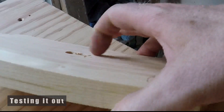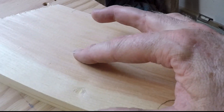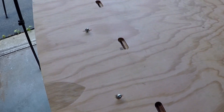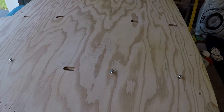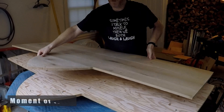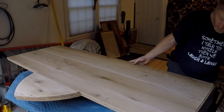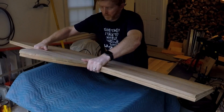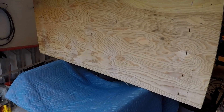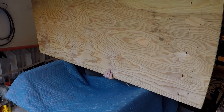I tested the appropriate height of the attachment screws using a scrap piece, then set all the screws at that height, locking them in place with a little bit of thread lock. And now came the moment of truth. I got a very satisfying clunk, then pulled down on the skin to engage the keyholes — and with my apparent success, I blasphemed just a little bit.